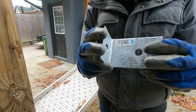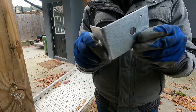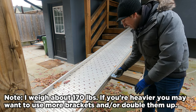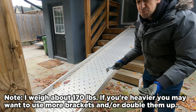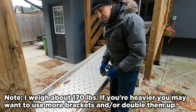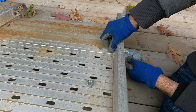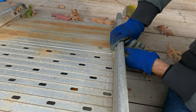What you need are these little L-plates - make sure you get the really thick, super heavy duty ones. I'll post a link to where I got these. They should be super strong and rated for a lot of weight. We're going to attach these throughout the ramp and they'll support wood planks that give us running boards for extra room in case we need to put our feet down. First thing we do is drill holes every three feet or so - just one-inch nuts and bolts, line up the hole, put it through, and tighten the nut on the other side.